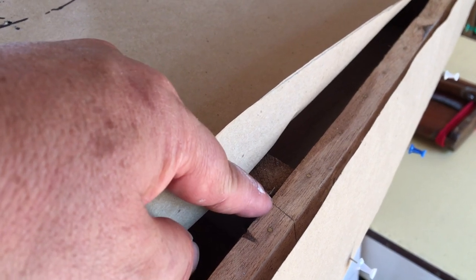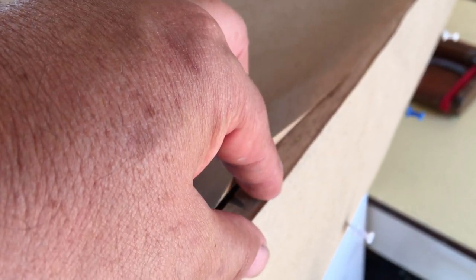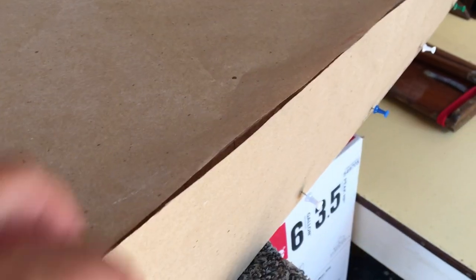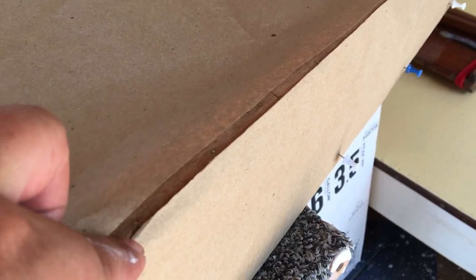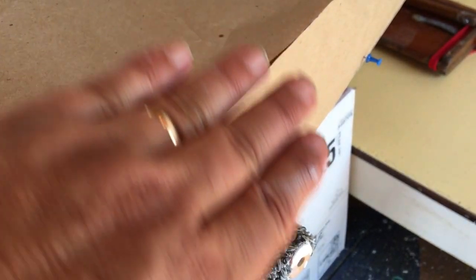Speaking of beveling, I'll make a note on the pattern that where the frames come down, the inner edge of the plank is higher than the outer edge because the bevel is going down that way. So I'll note to cut it to an eighth of an inch or so proud in that direction. That way we'll have room to shave the bevel — if we cut it only to the inner edge depth, the surface would be flat and the plank coming down at an angle wouldn't have surfaces to match up.